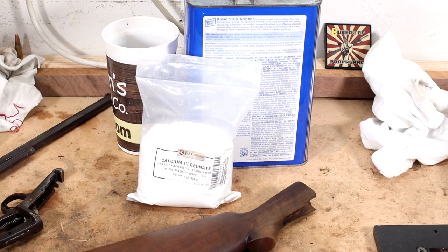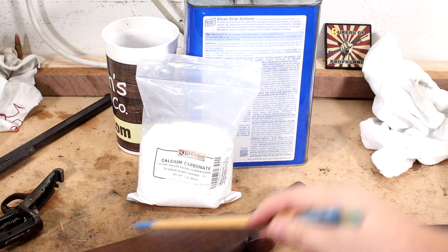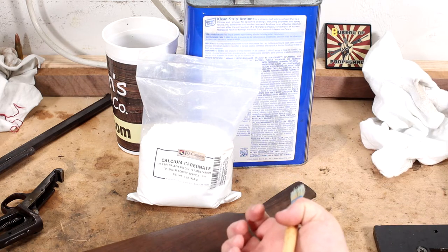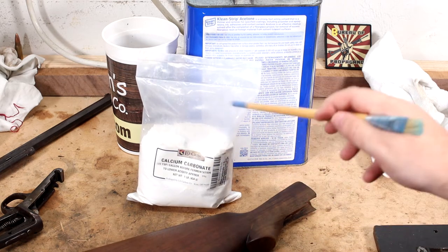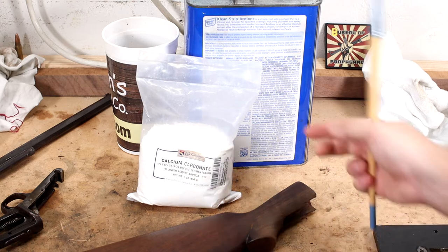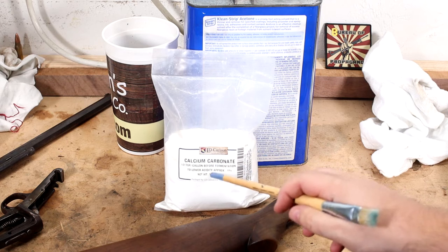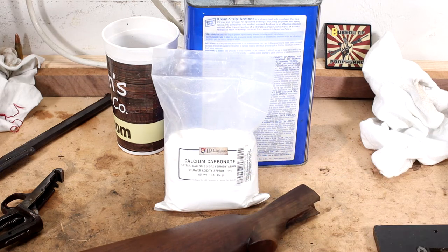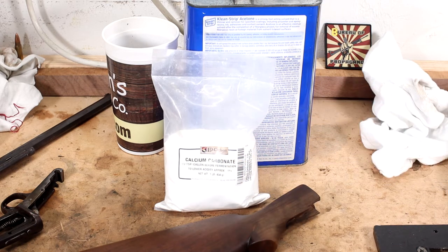All right, so stock whiting, what is it? Basically, it's using some sort of powder mixed with a liquid, painting it onto your stock, and then heating it so the oils will seep out of the stock wood, the grain, and get captured by whatever your whiting compound is. I did a search for the Brownells whiting compound and found that in their MSDS, basically all it is is calcium carbonate. So I ordered some of this off of Amazon. Wherever I got it, I'll put a link below. It's just a big bag of calcium carbonate, and a pound of this stuff should go a really long way.